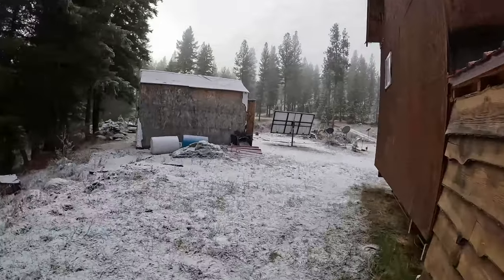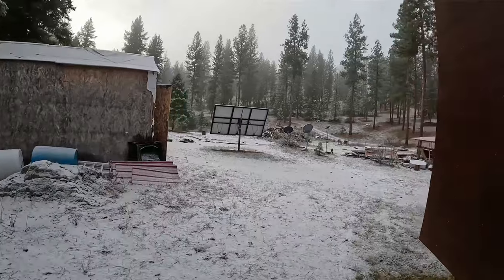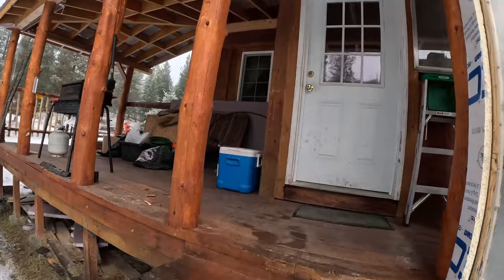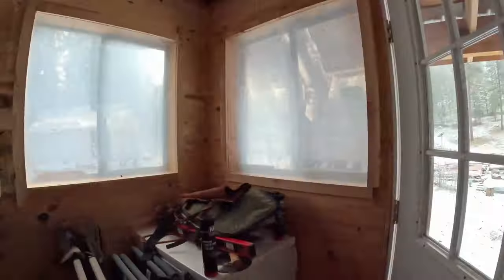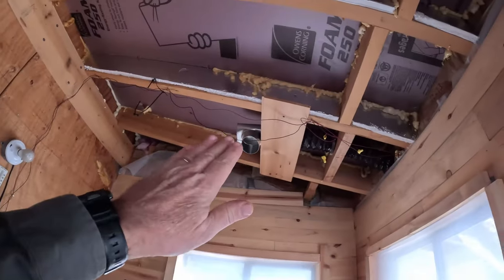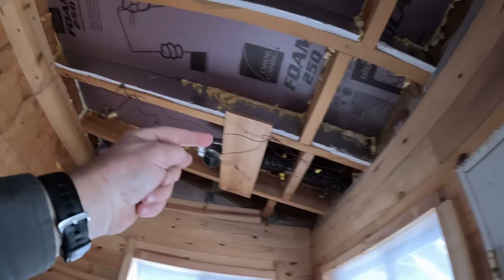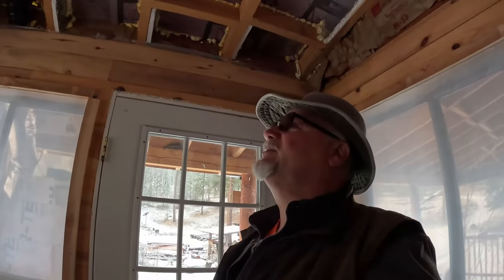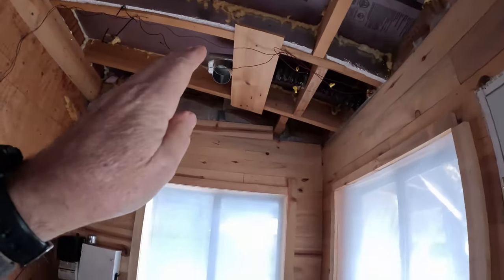I also noticed something about this heater — because I don't have a baffle in there, it was definitely reverse-flowing overnight. I put a thermometer down here to check and it's already down to 44 degrees. Hot air rises and goes right up that pipe, down to the heater, then comes back in cooled — kind of like natural air conditioning, and we don't want that. I need to either put a baffle in, change how I've run it, or do something to stop that. The porch stayed around 60 degrees overnight, but this morning I could tell a cold breeze was coming in.